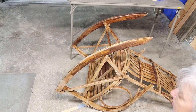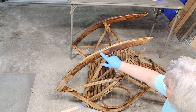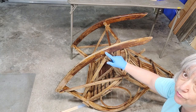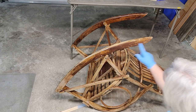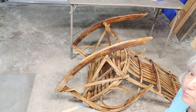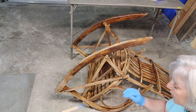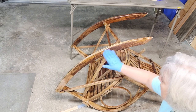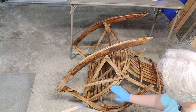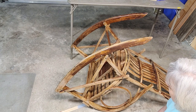And this is a rocker. It's going to be out on the back porch, so it's not going to be pristine. So like here, some of this got darker than this, because this is where the previous varnish was. And so it may end up looking a little splotchy in those areas. You know, I sometimes like that. If I wanted it pristine and perfect, then yes, I could have sanded that a little bit more and gotten that varnish off. However, it's going to look just fine once we get it all done.